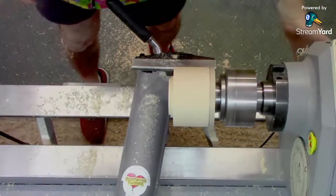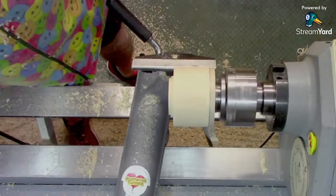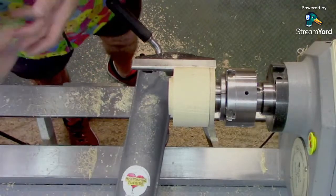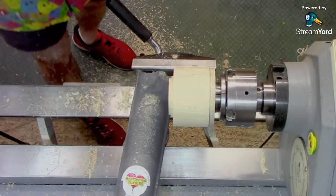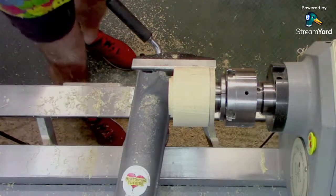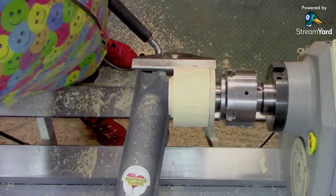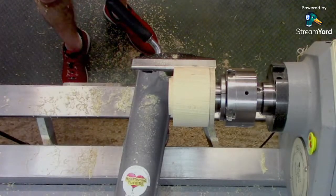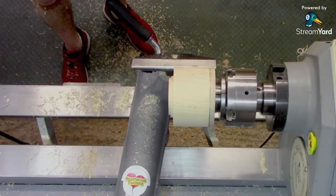Would do says the beading and parting tool works much better when the hard angle on all four edges on the stem are rounded a little. Works a treat. Oh, yeah. For rolling beads and stuff, it does. Yeah, absolutely. Totally agree. I haven't got around to doing any of that on any of my tools yet.